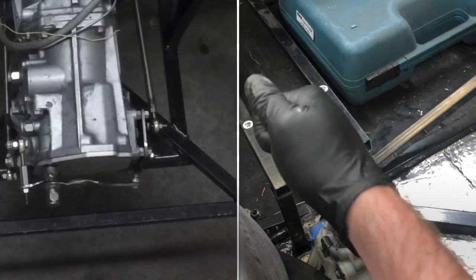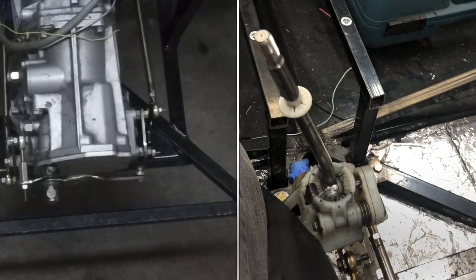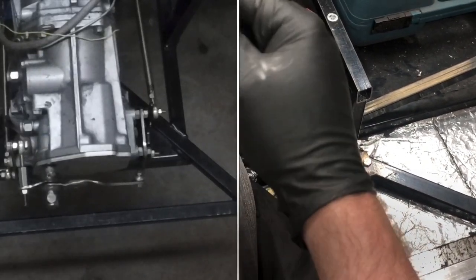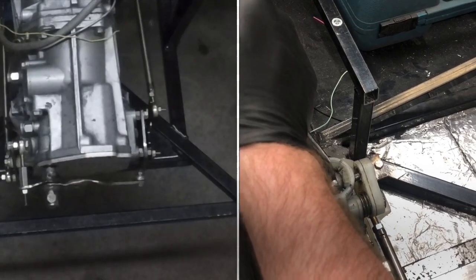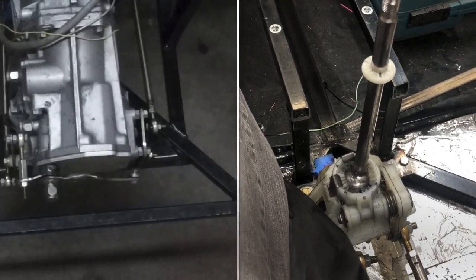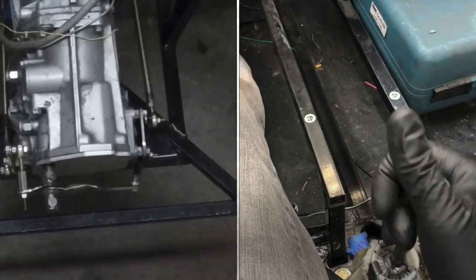We can go back the other way: Five, Four, Three, Two, One. I don't quite get the engagement and the click I'd like on one, so I'm going to try and adjust it just a little bit. I've got the adjustment on the heim joints on each end as well as the heim joint on the bell crank. I'd like just a little more solid click there at one — I get a good click coming back to neutral and two. Oh, I got a decent click on one that time. I probably just need to get it tightened up a little bit on the alignment. You can hear five when you go in really well — you hear the reverse lockout. So if you come from five, you can't go into reverse; you've got to come back and you'll hear it release and then you can go into it. And it's loud when it goes into reverse as well.